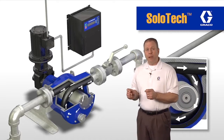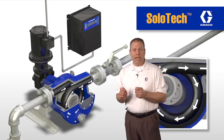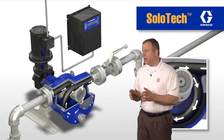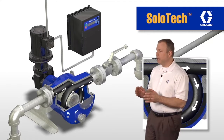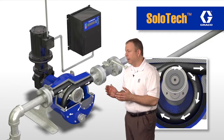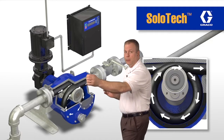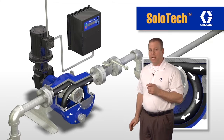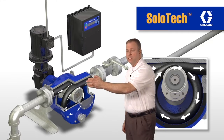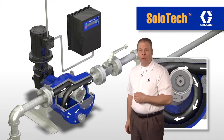The other way is we can add a pressure transducer to the system where we can actually maintain a programmed specific set outlet pressure. We can also stall that pump to pressure. For example, in normal operations as this pump is running, if we get some restriction or if a valve closes down on the outlet, then the pressure is going to build up between the valve and the roller. By using the pressure transducer, we can maintain and stall the pump to maintain that pressure within the system until the valve opens or the restriction goes away, and then the pump continues to operate at normal levels.